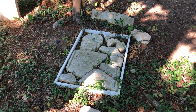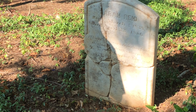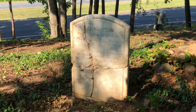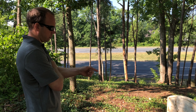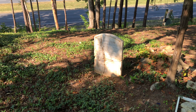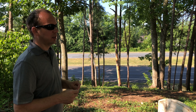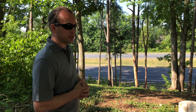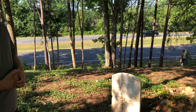The pieces are probably somewhere on the property — we just don't know where. Someday, maybe erosion will make them visible and we'll find them and put them back together. This one is a good find because it was broken and then covered up with decomposed plant matter. It stayed not visible for years and years, so it was pretty much undamaged. That stone was broken in nine pieces, and I was able to find all the pieces, dry fit them back together, and then use a polymer concrete epoxy to hold them together. It's two parts. After about a week, it's super hard, and it seems to hold the stones together very well. It withstands frost freezing and thawing, and so far, so good.